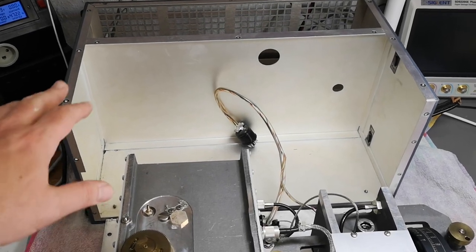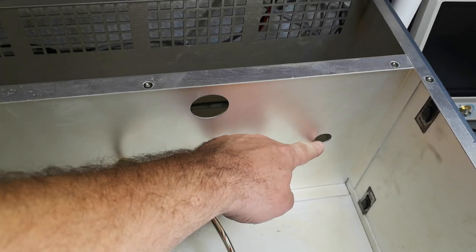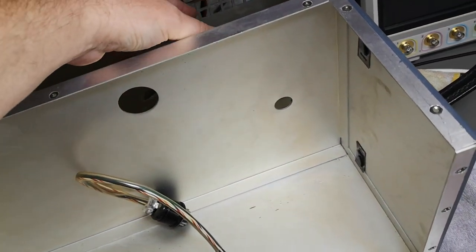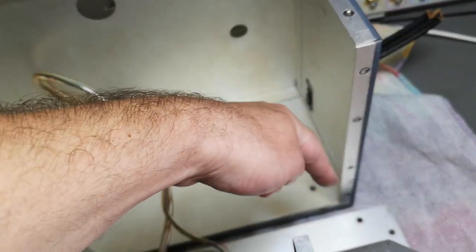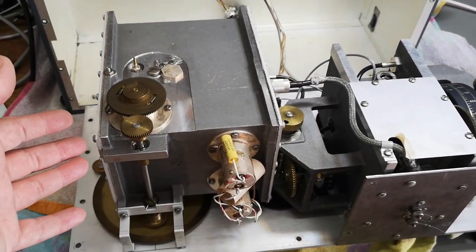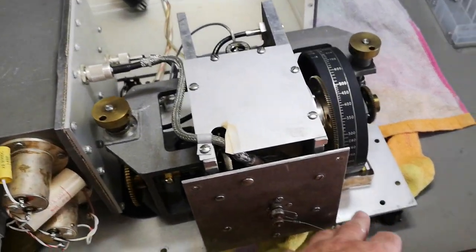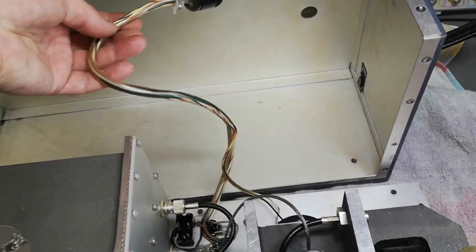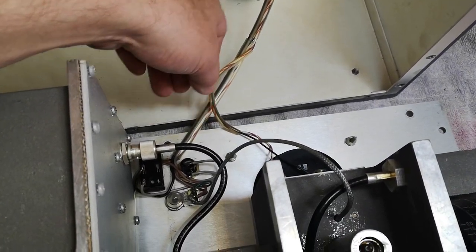To pull the unit apart: the 100 kHz amplifier has a coax cable going through a hole connected to the bridge. The only way to get the amplifier out is to remove this coax cable, and you can't reach it by hand. You need to unscrew all the front screws and tilt down the entire front panel assembly. Put something soft underneath so it's not resting on the meters or knobs, and now you can see a lot more of what's going on and pull out the connector through the hole. They thought about all these things — everything is made really beautifully.